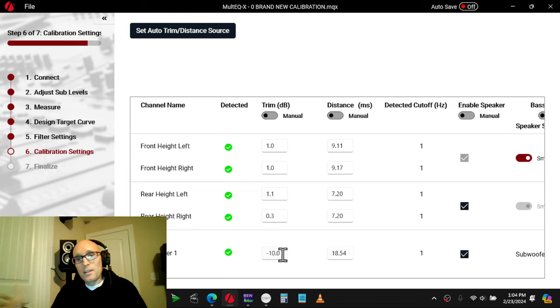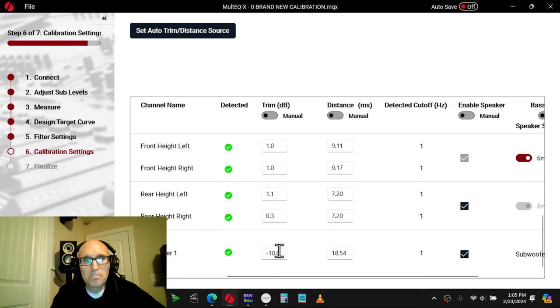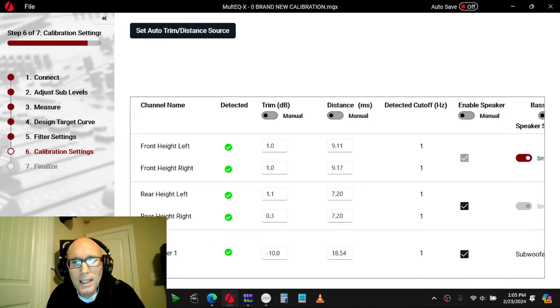The subwoofer channel is 10 dB hotter than all of the other channels. When using an RCA, if you're trying to reach reference levels, there's just no way. You have to put a negative 10 on this. But again, I've heard the new Denon with XLRs, and XLR outputs in general do not do this. They have a 4 volt output, and they can handle a lot more. Again, I've heard they don't clip. But I'm taking care of this. I heard from Joe and Tell that he sets his to negative 6, and it doesn't clip reference, but I want to make sure. I'm just going to put a flat negative 10 on the subwoofer channel and get that taken care of.